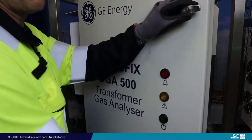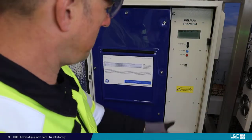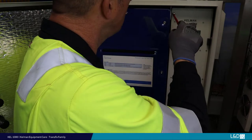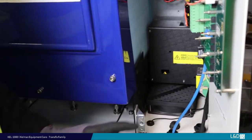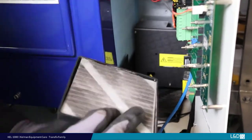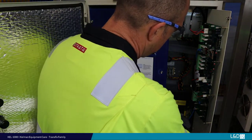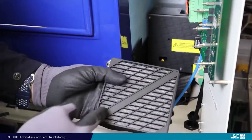Open the main door. Open internal zone 2 door. Loosen the two quick locking screws. Inside the bottom of this zone is located the inlet air filter. To remove, simply pull up the black cover. Inside you should find the gauze filter and mesh. There may be a transportation cable tie that requires cutting — this cable tie does not require replacement. If there is a lot of dust in the fan blades, use a brush and/or compressed air to clean out. Replace the whole filter assembly as shown, making sure to line up the top cover crossbar with the fan assembly crossbar.